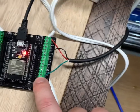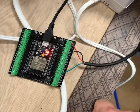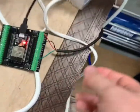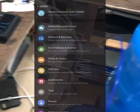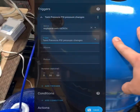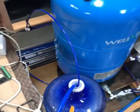These analog input pins can read a signal from zero to 3.3 volts. Luckily the signal isn't going above three volts because I'm not going above 150 psi, so this works well. Now I have a digital version of pressure in Home Assistant, so I can say: when the pressure drops to 50 psi, run the pump — it'll pump up to around 90 psi — and then keep running that automation, cycling from 90 down to 50 psi automatically.